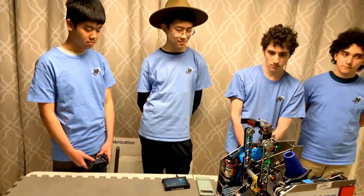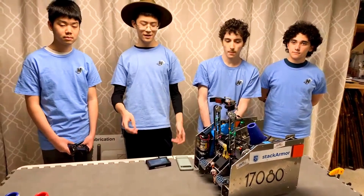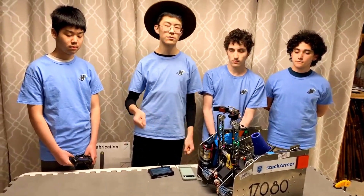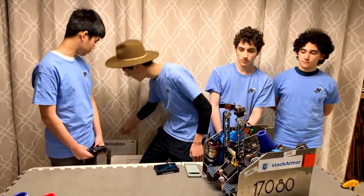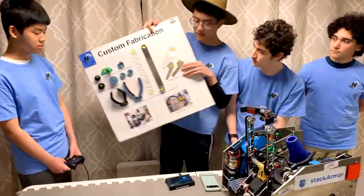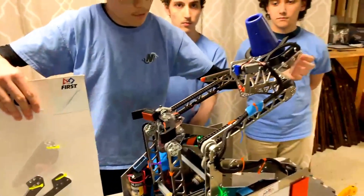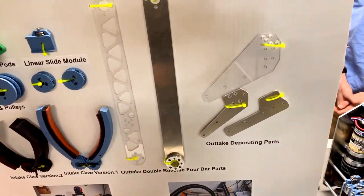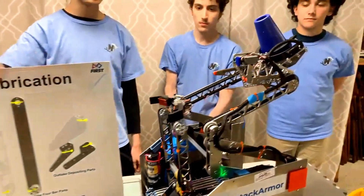What was the most difficult part of your transfer process and how were you able to solve it? This transfer is a fairly convoluted transfer, especially for this season. One of the main issues we encountered was tuning what position the outtake needed to sit, because even sometimes if we were off by about five millimeters in any direction, the transfer would fail. We actually made several iterations of the mounting — specifically a Lexan part — mostly just tuning specific positions. After about four or five iterations, we were finally able to dial that position in to get a successful transfer.